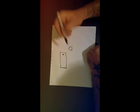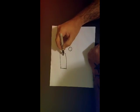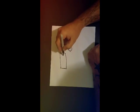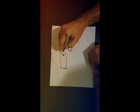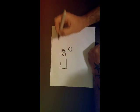You can't measure into the tube, so this is common sense to a lot of people. The easiest way to do that, you measure from the center of the hole to the edge of the tube, the closest point. So in our case, what we have is 1 3/8 of an inch. So the distance to the tube is 1 3/8.